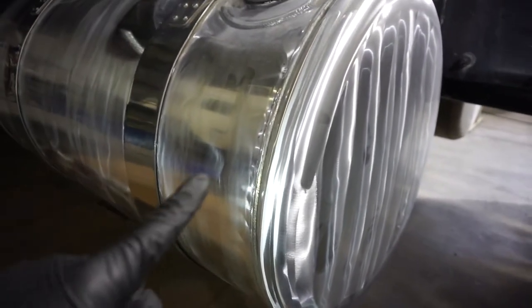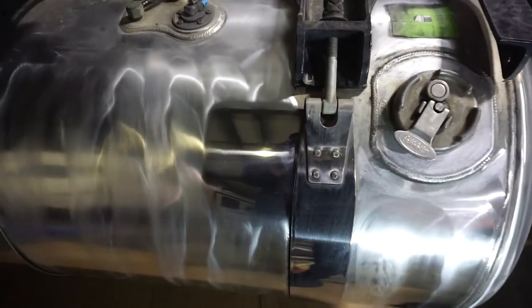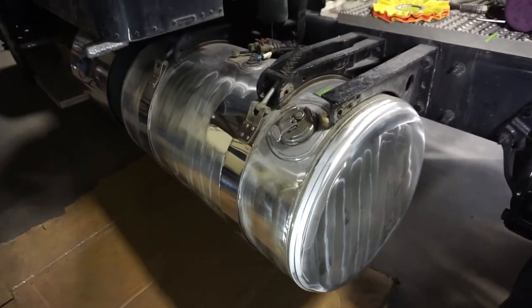Once it's leveled like this through sanding, the next step is to actually polish it. I did a little test spot here and you'll end up with a mirror like this — extremely reflective and super sharp — because you properly sanded and got it ready to be cut. Once it's cut, you move on to the finishing steps, and once those are completed, you've got a metal mirror.